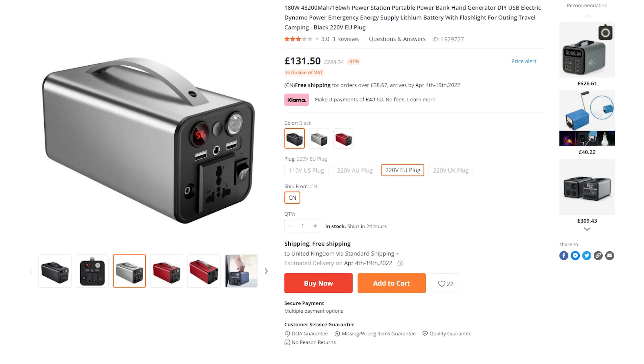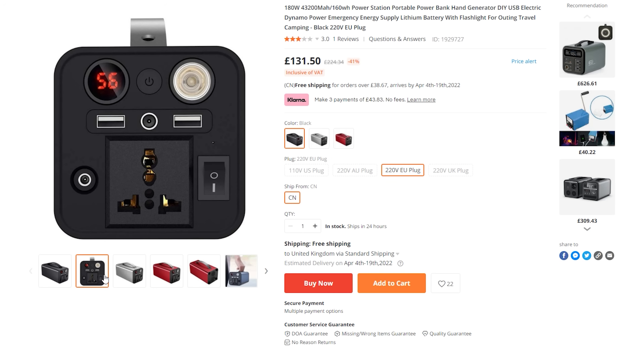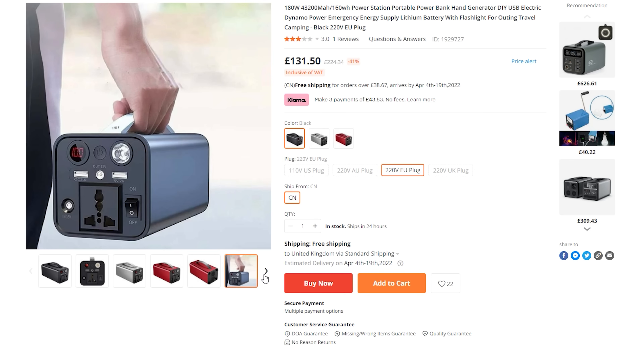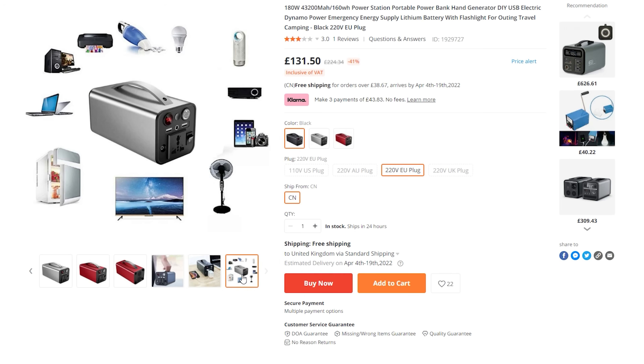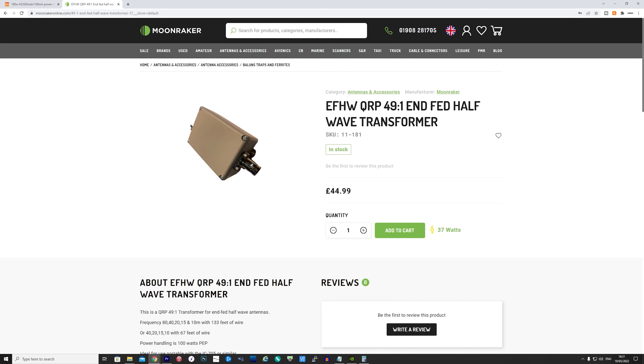From these video clips it just shows you don't need a lot of power or a massive antenna to make decent contacts. I'd feel quite happy with my backpack on top of a mountain working stations with this setup. Of course the power bank I'm using is rather large to carry to the top of a mountain, so there are smaller alternatives like LiPo batteries. The power bank from Banggood has a 12 volt output rated up to 15 amps and is advertised at 45 amp-hours capacity. As a test I left the G90 connected for 12 hours on receive and the percentage only dropped from around 100% to around 89%.